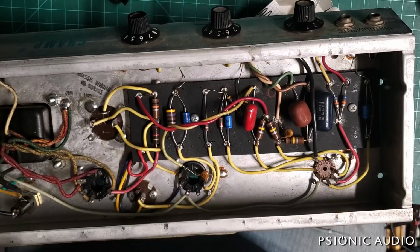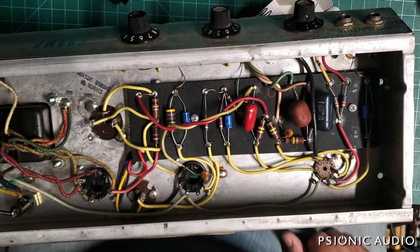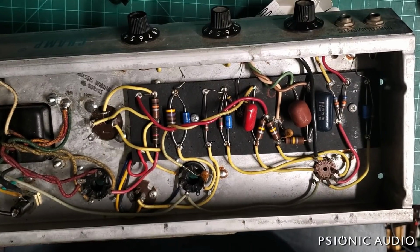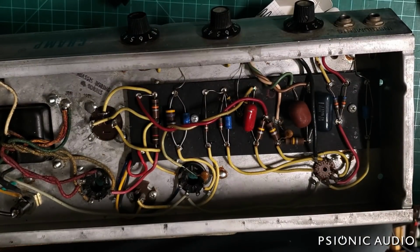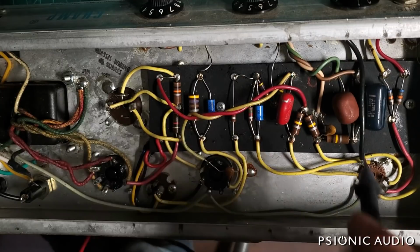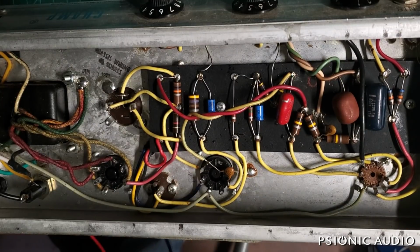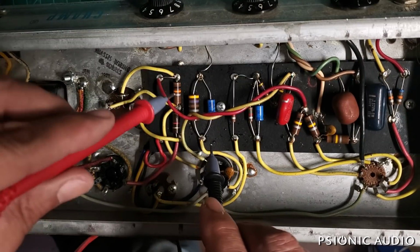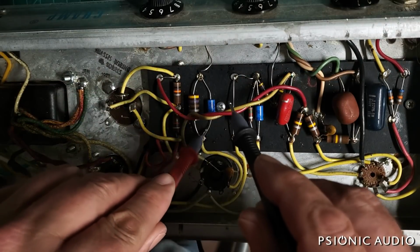I am going to do some prettier domes on these, but I like to keep my method on that my little secret. All right, I haven't domed these because I might change this resistor. I've domed the other ones. I measure the bias now for cathode bias single-ended. I've already measured that resistor. I'll measure the voltage across it.